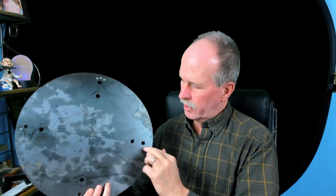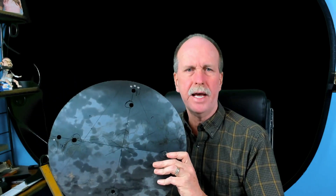This will be the plate for the table stand and this will be the lower plate. The inner holes here are where it will attach to the base of the table. The three dots up here represent north, south will have two dots, east will have a dot to the right of the center line, and west will have a dot to the left of the east-west line. Before installation, I'm going to take the second plate, put it underneath this one, and use the north, south, east, west holes as a template to drill through to the next plate — that way I know they'll match up. Then we'll dry fit this and assemble it into its final form.